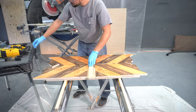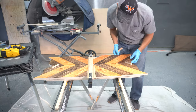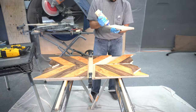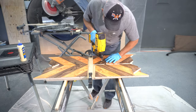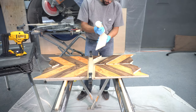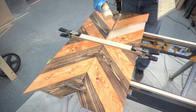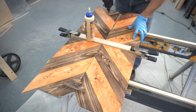Now it's time for glue-up. I take a straight edge or a spacer and clamp it directly on the vertical center line, then I start aligning my boards along each quadrant. Just make sure to take your time and align everything properly to minimize gaps. Plenty of wood glue and some inch-and-a-quarter brad nails are sufficient to hold them in place. It kind of feels like putting a puzzle together — except in this puzzle, you are the one creating and cutting all the pieces.